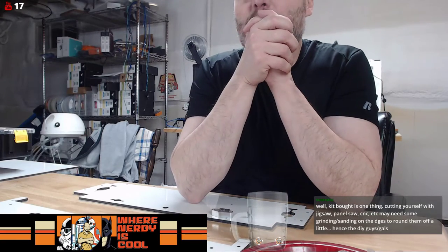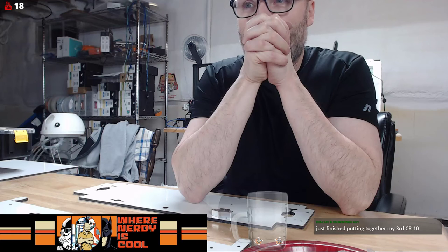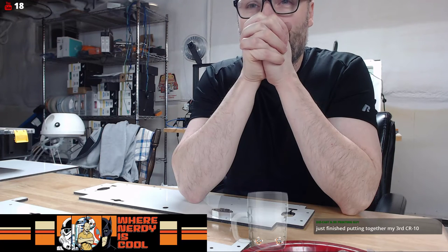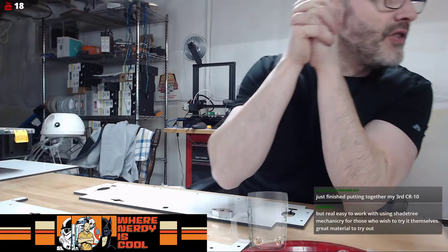Let's see. Mount the NEMA 17s using the included hardware. Mount a pulley upside down to... All the bolts go on the bottom. Okay, we need to clean up that English a little bit. All of the bolts go on the bottom. So I'm assuming, if we're looking at the graphic here, what he means to say is the bolts should come in from the bottom.